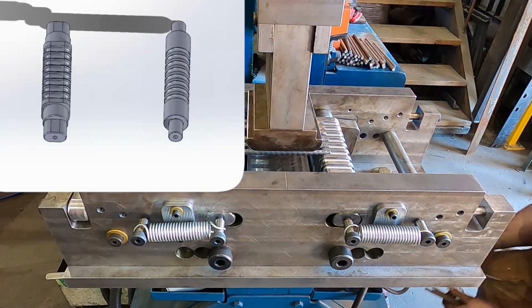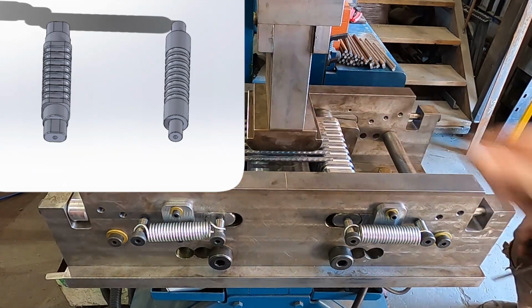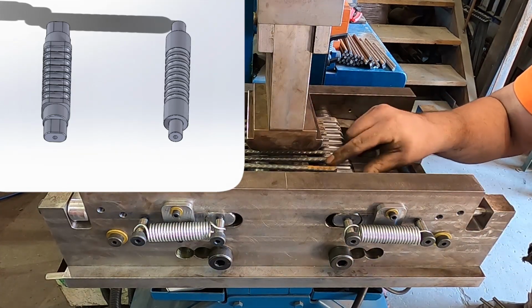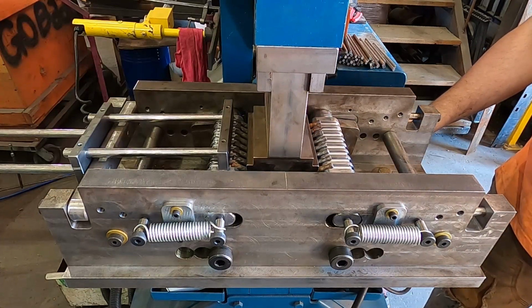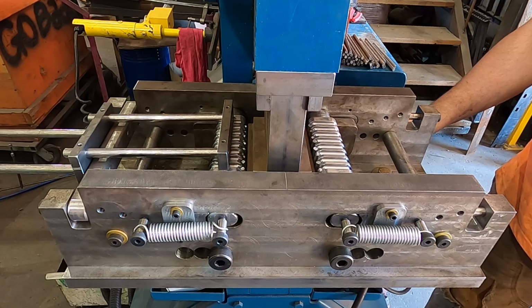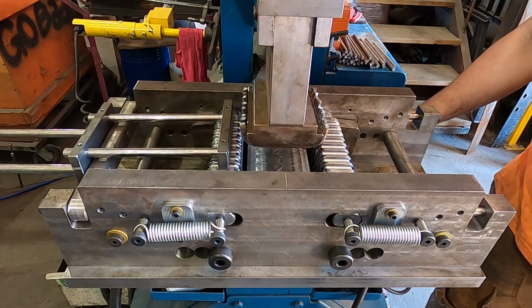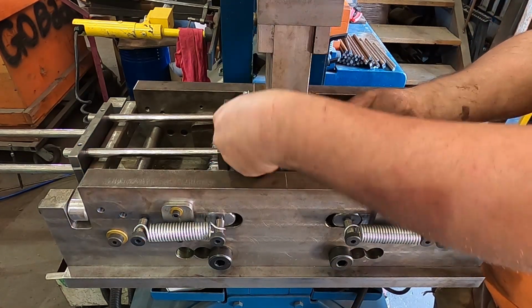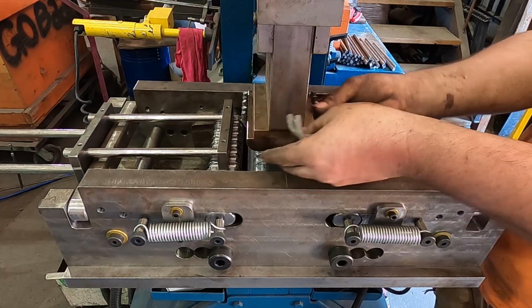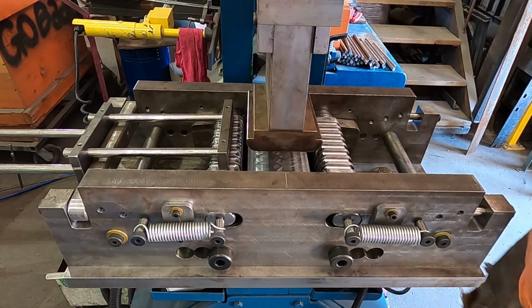For the bending of rebar with shorter legs, I made square top rails with radius corners and oval ends to keep them from rotating. Both ends of the sides have slots to hold adjustable stops for positioning the rebar before bending. All the non-contact pieces were made out of pre-heat treated 4140 material, and the contact pieces were made out of S7 material and then heat treated.